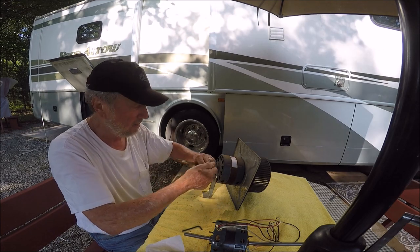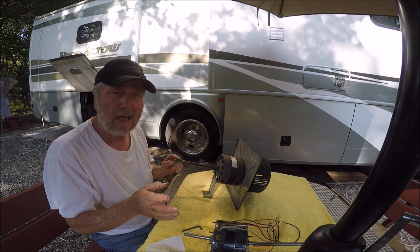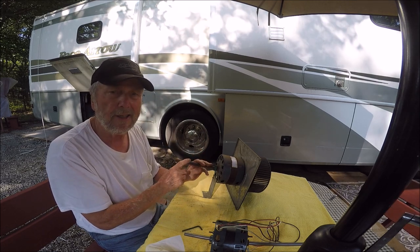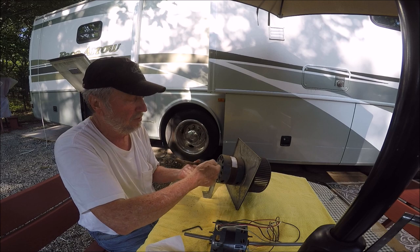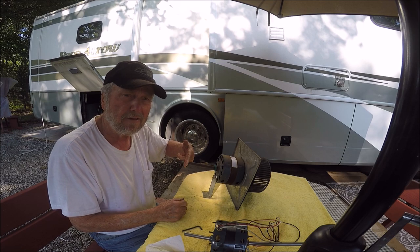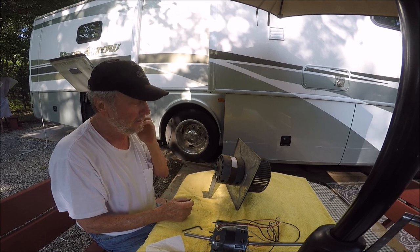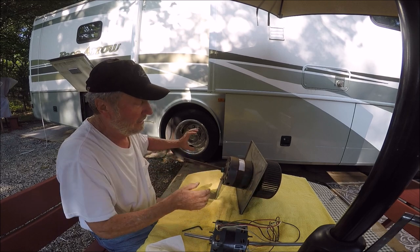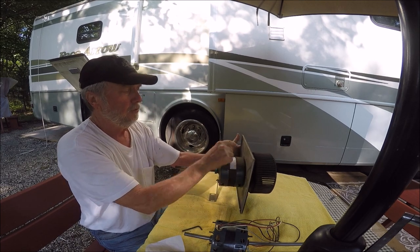Just a little at a time — you don't have to drive it hard. You can spray some penetrating oil on here ahead of time, let it sit for a while, rotating the shaft around and letting it work in good. That may help remove it. Just little taps going back with some sort of blunt tool that you put up against the edge of the fan blade shank — not the blade itself but the shank — and it will slowly move off. Then you'll move it over to the side, up into the shroud, and you'll have room.